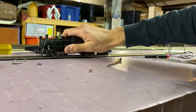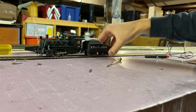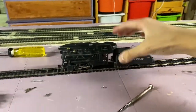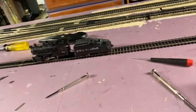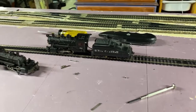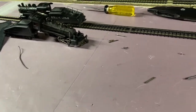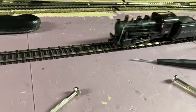The drawbar screw fell through — okay, maybe it was the smaller one. It has a bigger head to the screw, but for now that's fine — just running around like that. Here is the locomotive back together. We're going to switch it on — we're in forward, we're going to apply a little power. Give it a little nudge to get it going. There we go guys! It definitely needs a little bit of lubrication, but I can tell you it's running much more efficiently than before. Very smooth at low speeds. Running much more efficiently — so I would call this a definite success guys.